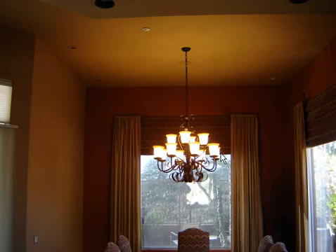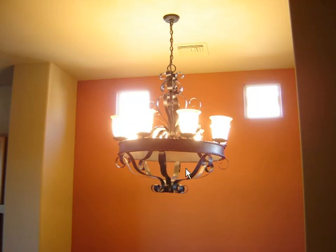You really can't tell the difference between the 60s and the 100s, especially when you've got 12 light bulbs in there. We had the same problem over here — this one's got eight light bulbs in there. Once we changed that out and put in the 130-volt regular A19 light bulbs — I had these on a 1,500-watt dimmer — the humming of the light bulbs themselves virtually went away.